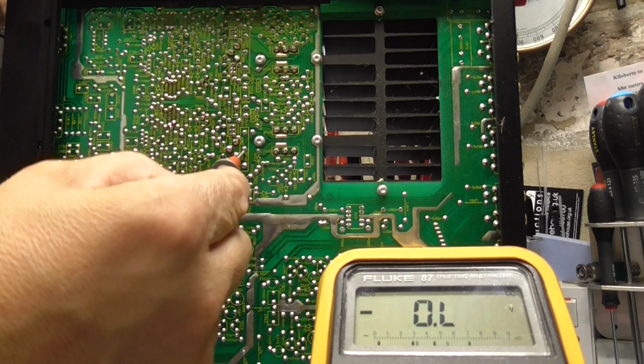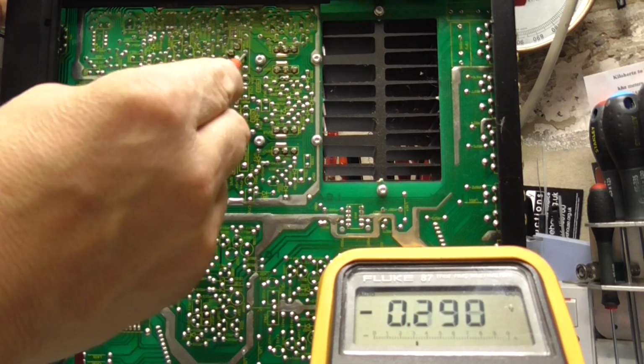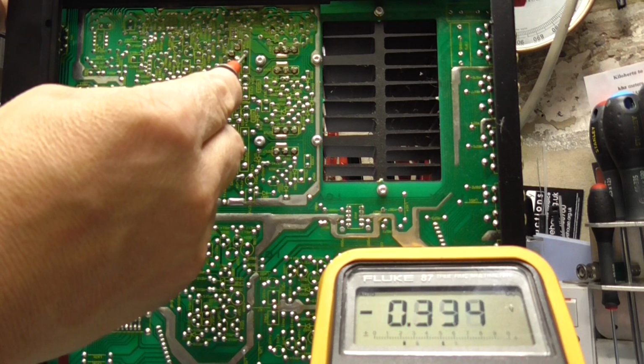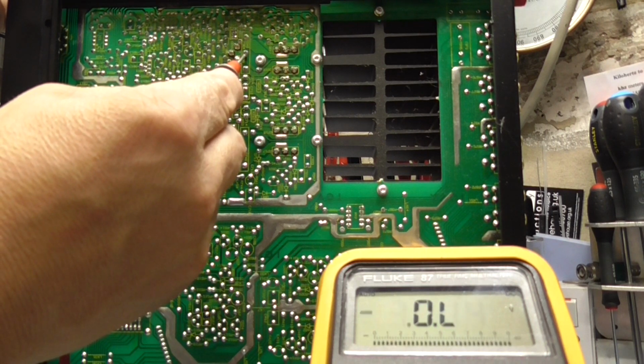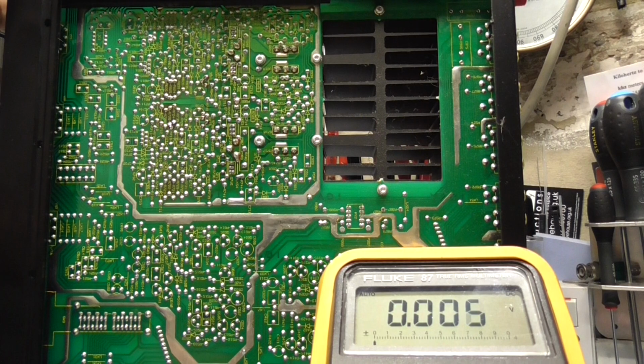So I'm going to turn the amplifier off. I'm going to look on the other amplifier, just give it a second to discharge its capacitors. I'm going to do the same thing. I'm going to switch it on now. Same thing, it's all jumping around all over the place, stabilising, stabilising. Once it's down to it, it should release now. There you go, protection circuit's released. So, alright, it's intermittent here. It definitely was worse than this one at home. It wouldn't even release the protection circuitry at all.